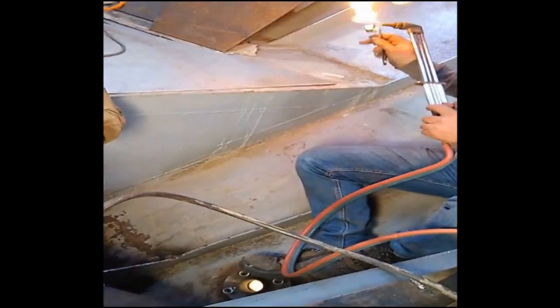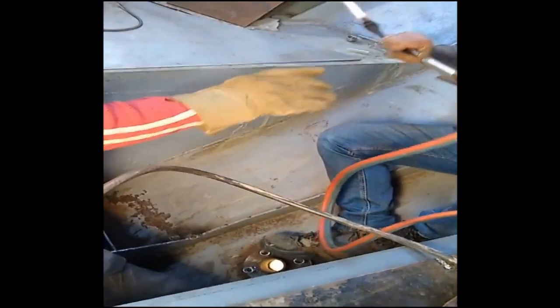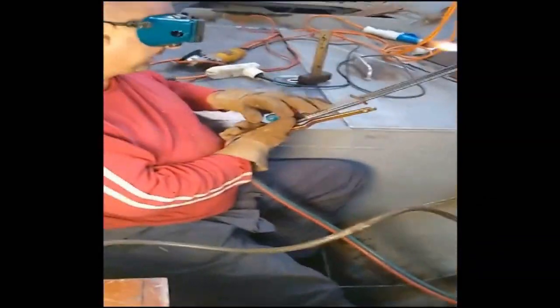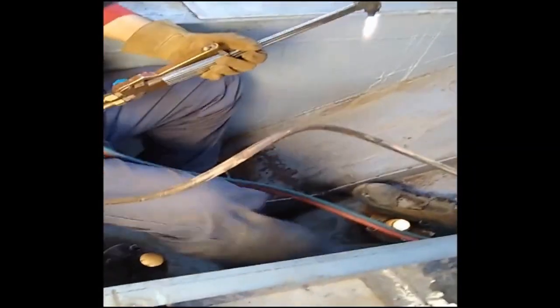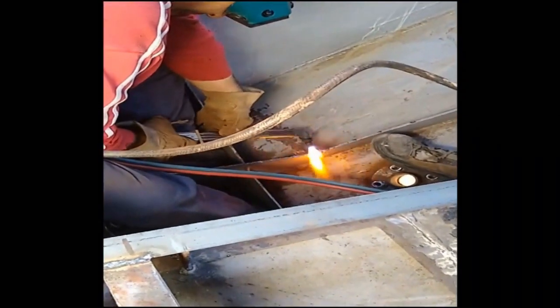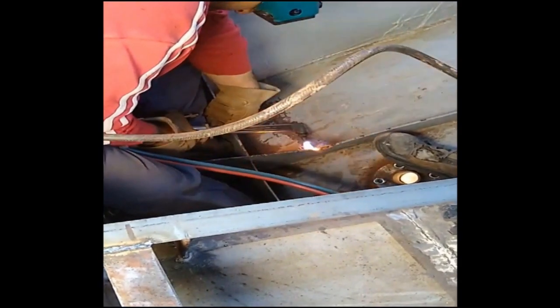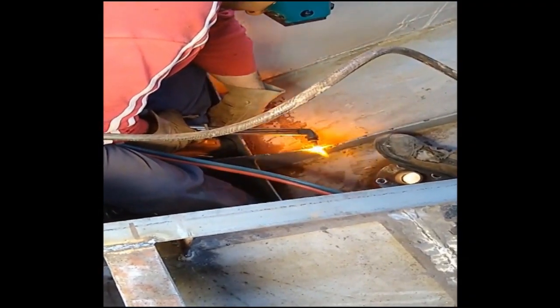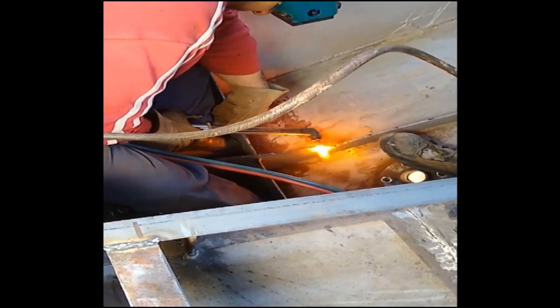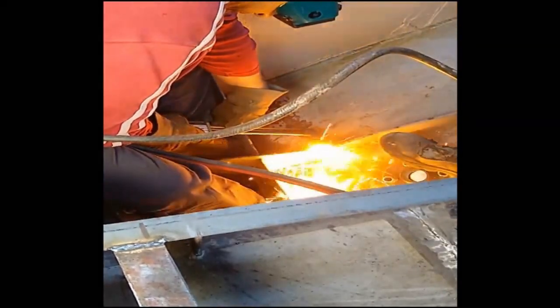Even if you have damage to the echo sounder or need to replace the sensor, you don't need to haul the boat every time. Just take it out by disconnecting the cable from the top and pull it out, because the box will be enclosed. Started off by cutting out part of the beam with the cutter, so we measured exactly where the echo sounder was going to fit.